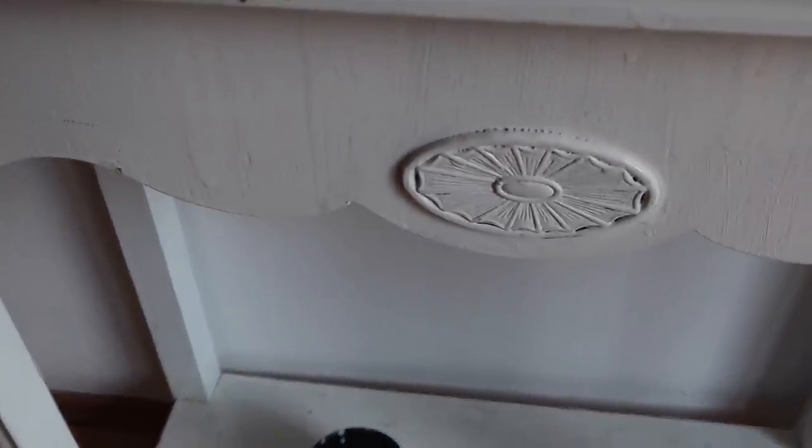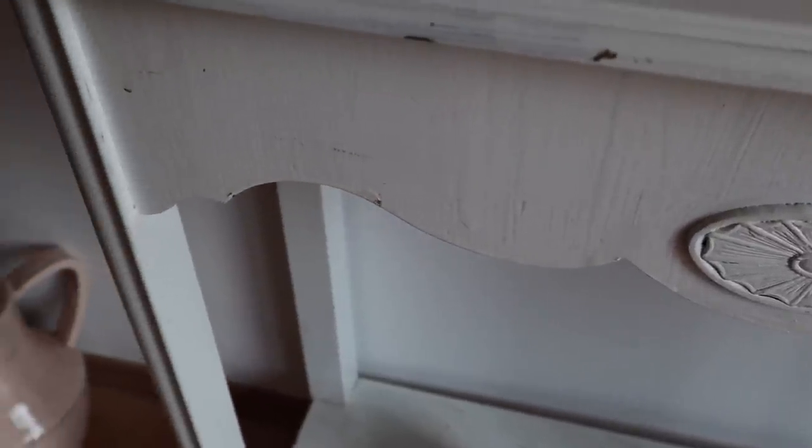So like I had told you guys before, no paint, no matter what it is, is going to go over this and fix this finish. So really the most proper thing to do is either sand it all down smooth or strip that existing finish off.